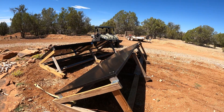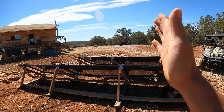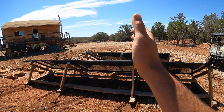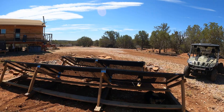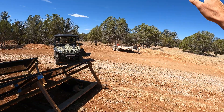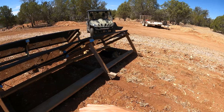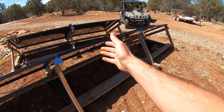Then I'm going to get into the next part of trying to get as much out of these bifacial solar panels. Right now I have them facing a southeast direction, so hopefully the morning sun will start hitting them sooner. And then as the day goes on and the sun is setting, I want to put some type of reflective panel so the sun can come in and bounce underneath the backside of the solar panel. That's the benefit of these bifacial panels - they collect light on both sides.